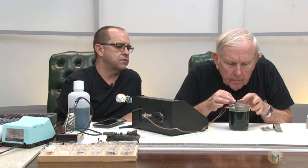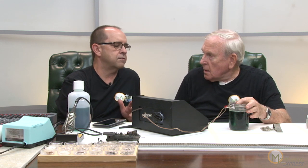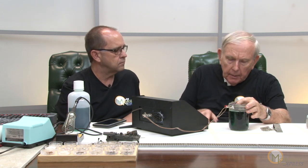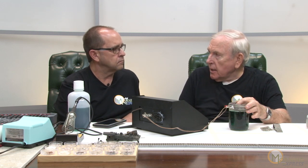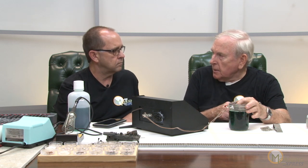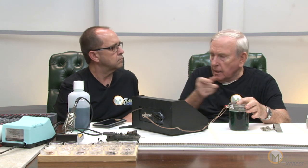A couple of other questions: we talked earlier about plating side rods, but you might not want the side rods nice and shiny with a nickel plate. Well, if your rods are already plated in good plate, something I've done in the past is take a piece of wood and tape down some masking tape sticky-side up, stick the rods on that masking tape on the back side, take it in my sandblast cabinet, and do about one slow pass down. It'll dull them down and give it a steel gray color. That's a good way to handle that.